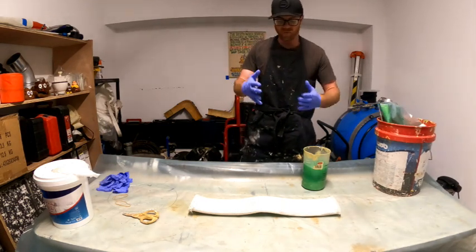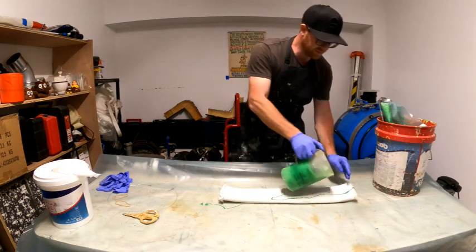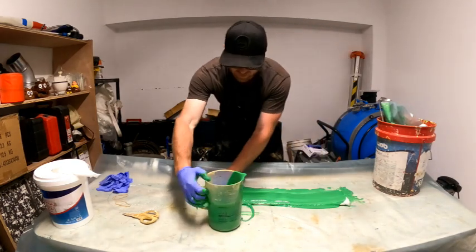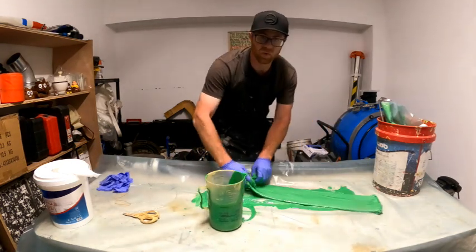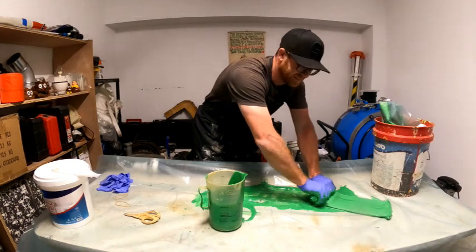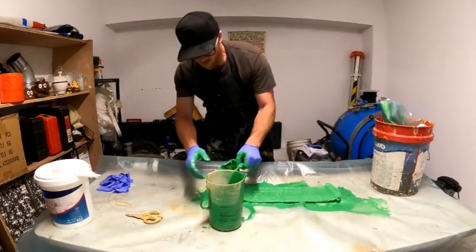We really have to make sure we get proper impregnation in this three-millimeter glass liner — there's no inner PU plastic in here. So spread the resin all over the top. You could try to push it in from the inside but that takes a really long time, so put a little on the inside and spread it all over the top. Then use the method where you roll and squeeze with your fingers. Since we're using three-millimeter liner instead of two-millimeter, it takes a little more effort, but the same method works — roll and squeeze, open it back up, go to the other side, roll and squeeze again.